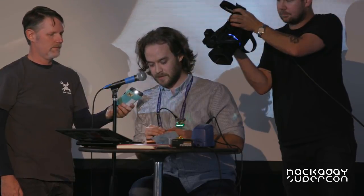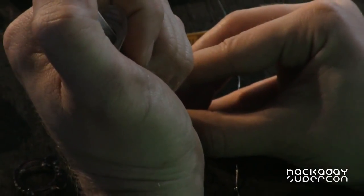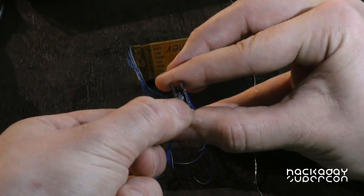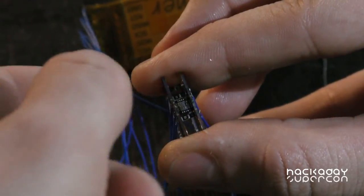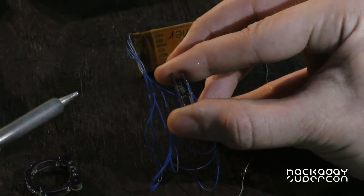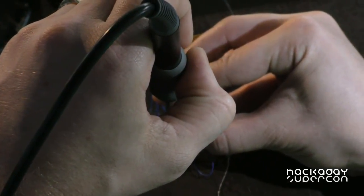I'm going to take one very close look at this to make sure it's aligned properly. Yeah, I think that's good. So what we'll do is take a syringe full of gel flux and just put a ton of flux right where we're trying to do our joint. We'll double-check alignment one more time — yeah, I think we're in good shape. And when I do soldering, I almost never hold solder; I let the iron do that. Just let the iron hold your molten solder ball and use your energy to keep things aligned. My iron is a Hakko, at 790 degrees Fahrenheit, with a 1/16-inch chisel tip. So we'll get a little solder on our iron, and then it's just like that.